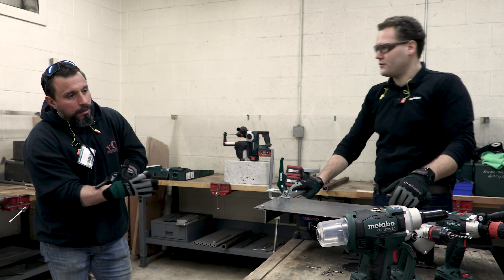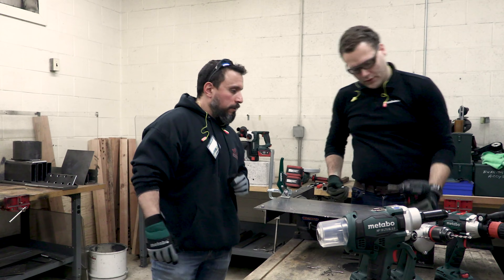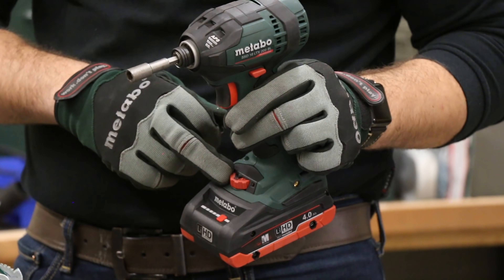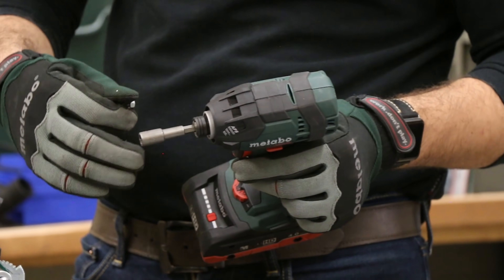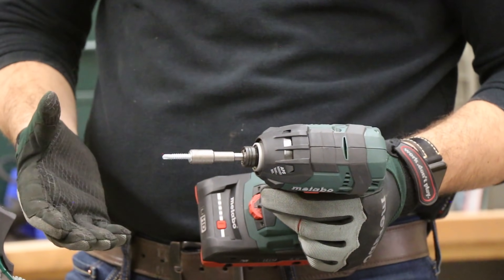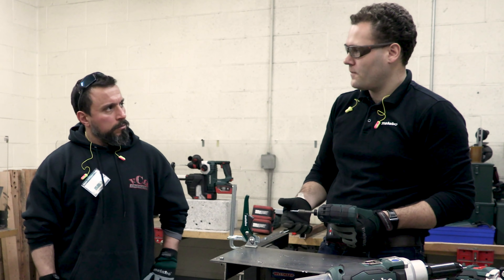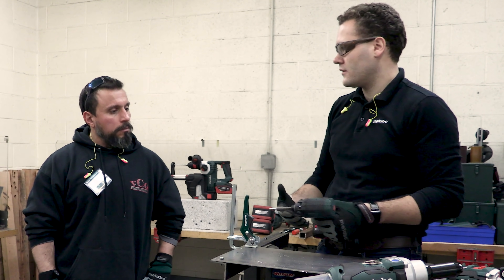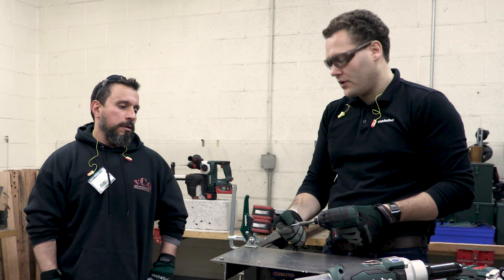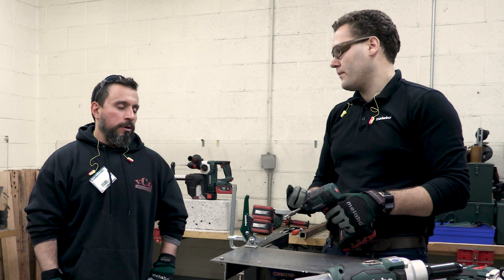The last option is to use a self-drilling screw. You take one of these and use an impact driver with a special mode — it gives you the full 4000 RPM, perfect for drilling metal. As it starts to cut the thread through, it slows down and gives you back control so you can stop when it hits. If you don't control it you're going to strip your screw.